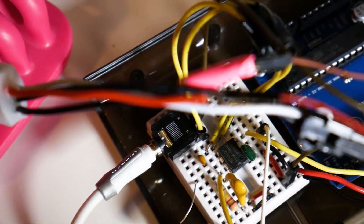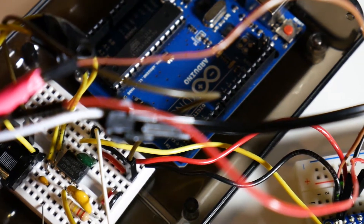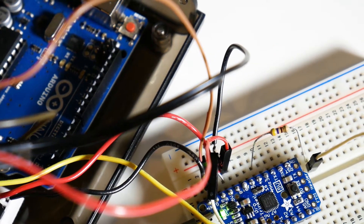The first step was to test out the code with the existing circuit on the breadboard to make sure it would work on the Trinket without issue. I tested that and everything worked as planned. I was also able to confirm that the issue was, as I suspected, a wire that had come loose. Next step was to lay everything out on the proto board. This was the first time I was actually laying out a circuit on proto board that didn't look like a breadboard — a bit of a challenge. I laid out everything in Fritzing like I normally do, but this time also worked a lot with the schematic and PCB layout. All those files will be linked in the Hackster write-up, which will go into a lot more detail if you want to make one of your own.